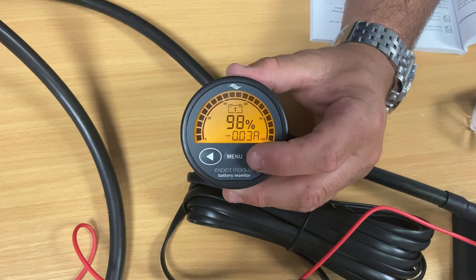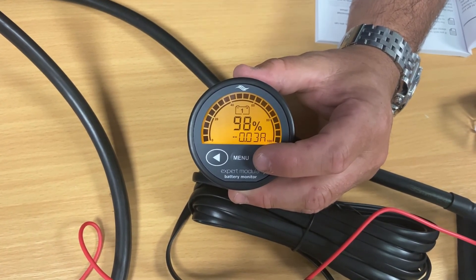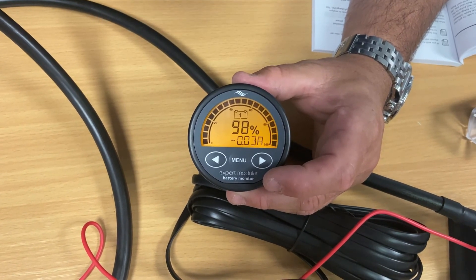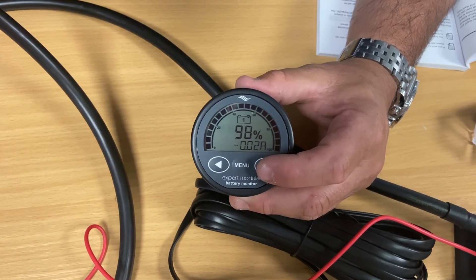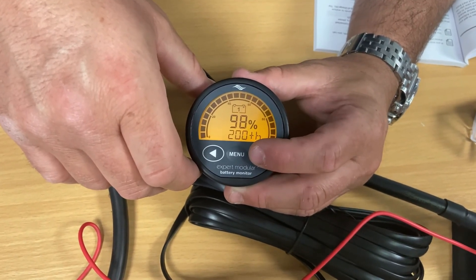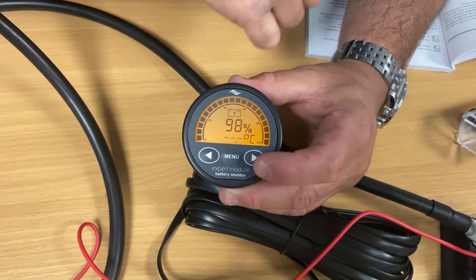The current function is really useful if you're running from solar panels — you can tailor the load attached to the batteries to ensure you're always charging. For example, if your solar panels are putting eight amps in and you want to run your fridge, freezer, and other kitchen equipment, you can switch loads off until you see a positive amount of charge going into the batteries. The display also shows how many hours you've got at the current rate of consumption until the batteries are flat — currently showing 200-plus hours, which is the maximum. If you have a temperature sensor connected, it will also show the battery temperature.